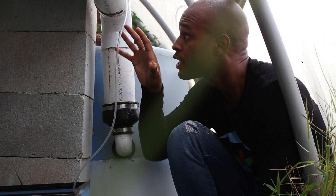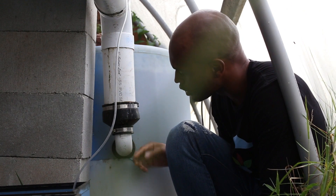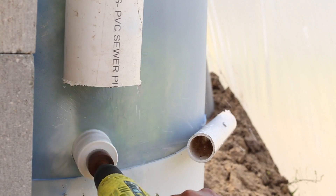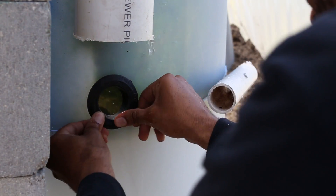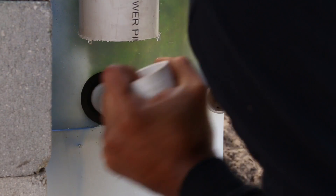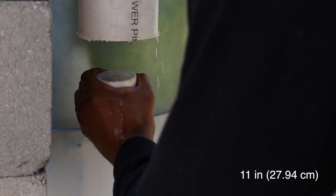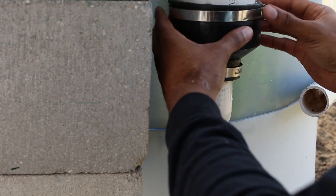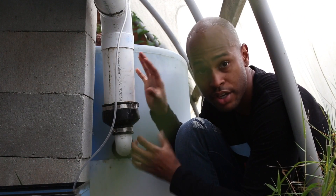The way this is connected is it's connected to the outlet of the fish tank — there's a 4-inch diameter sewer and drain pipe here, and it connects down to an inch-and-a-half piping. I made a hole using a 2.5-inch hole saw, placed an inch-and-a-half uniseal in there to plug it up, and then placed an inch-and-a-half pipe that goes half the diameter of the tank — around 18 inches. Then I put an elbow on it and connected this 4-inch to 2-inch rubber coupling, tightened it up nice and snug — that is the solid filter connection to the fish tank.